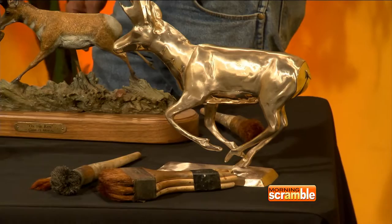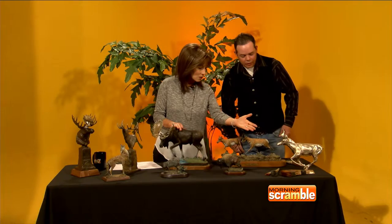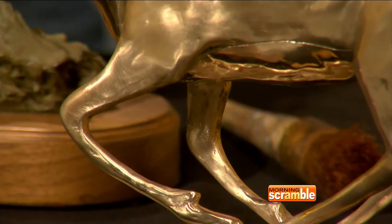And I work with so many well-known artists — because you do this patina for other people at Bronze Smith. Yes, yes. So I can keep learning, and it's great. Well, this is kind of a celebrity position because you make the difference in their art. How you patina changes it. So this is an original — this is what an unpatinaed bronze looks like. That's so beautiful. I did not know that bronze, when you brush it up like that, looks like that. Yeah, it's really shiny. Some bronzes are shiny, and I use black to make it darker in the recesses. A lot of different chemicals can be applied to make it different colors.